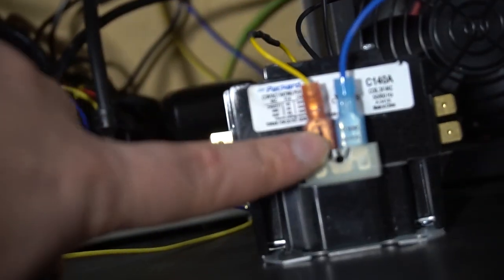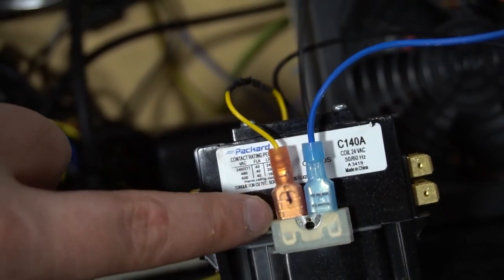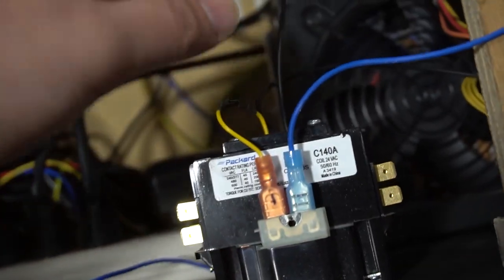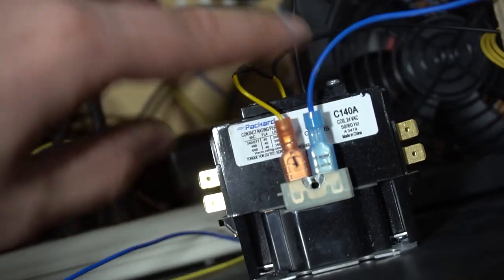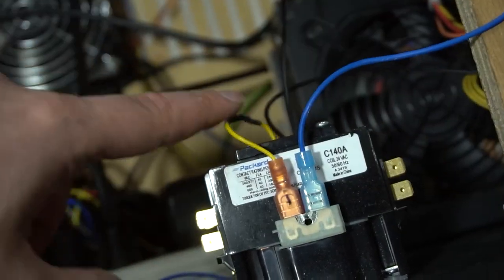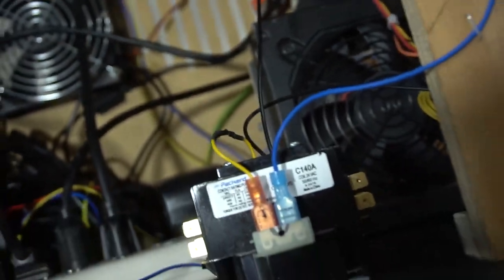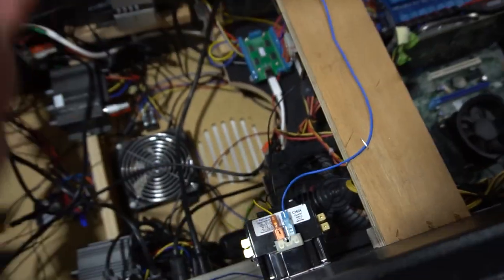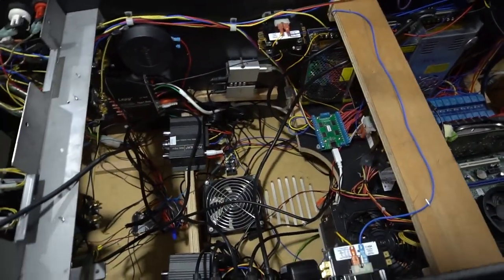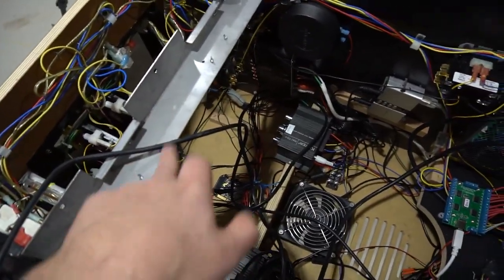The big thing, as you can see, the original builder has the diode, and he marked it negative and positive. Unfortunately, on like four of them, they were not wired correctly. This was really the positive side, and sure enough, this blew. So just got to be careful with that. But he did give me the diodes. The diodes were rewired. I had to redo three of them because I burnt out three of them. They literally poof, popped.